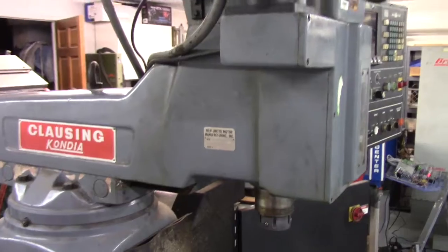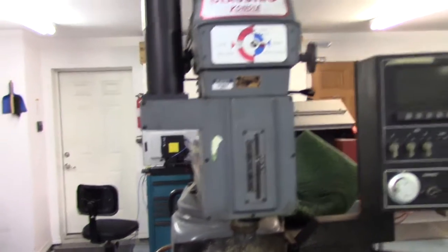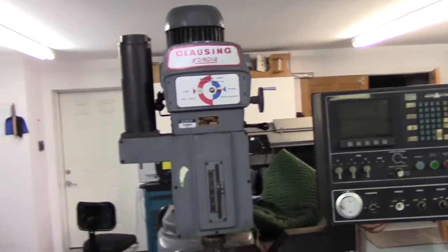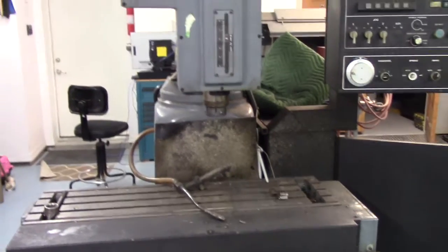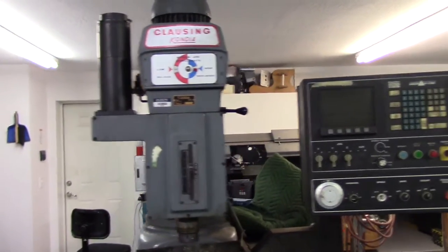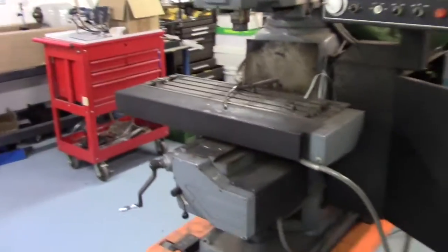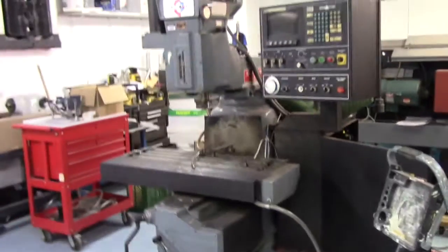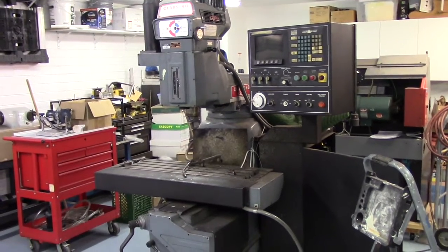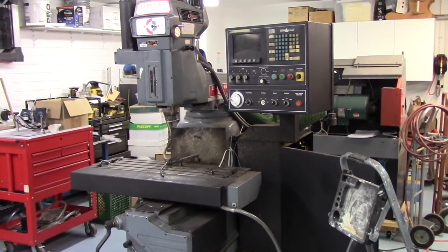And that's about it — so it's an upcoming project. I definitely want to try and fit a spindle encoder to the top because of the quick change tool holder system on the spindle, which allows me to mount a spindle encoder up top. Stay tuned for some upcoming videos on this machine. I have some other projects I need to wrap up first, but we'll get going on this as soon as possible. Talk to you guys soon.